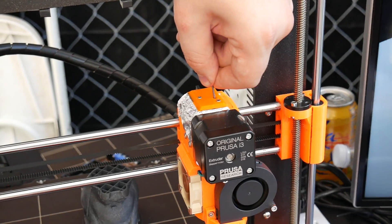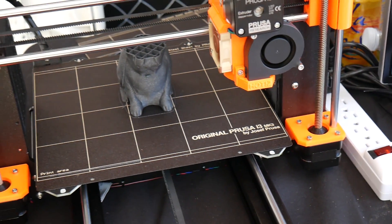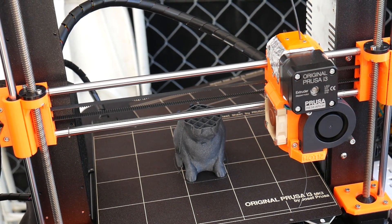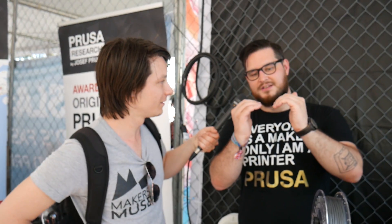It's also contactless. When we tried filament sensors with mechanical switches, the filament just grinds them off and they stop working. And if the extruder jams, the printer doesn't know. But since this can detect movement, we can find out if the hotend is jammed and, for example, offer a cold pull to try to recover. That's a big thing — with mechanical switches, the filament just grinds and the printer thinks it's still printing. We also now use Bondtech on the Mark III. We used Bondtech for the multi-material upgrade and loved it, so it's included here. The filament is driven from both sides, so grip is extremely good and it dramatically improves flexible filament printing — great for TPU and experimental filaments.